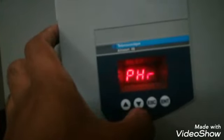OIL is the activation of current overload. We have activated it because we don't want to motor overload. LOC is 100. This is the current overload threshold, which is 100%. We have configured as 100%. TOL is the 100. Overload time is 10 seconds.